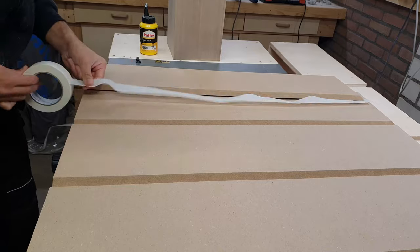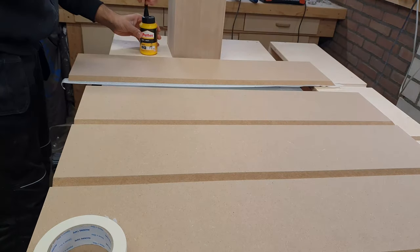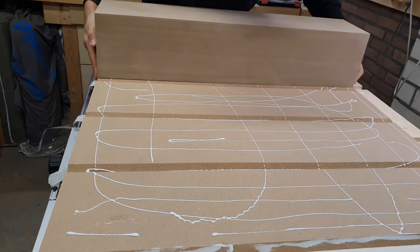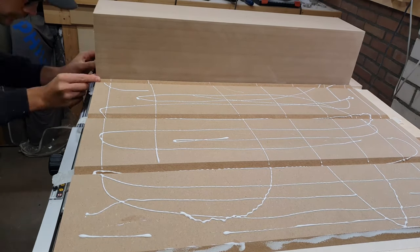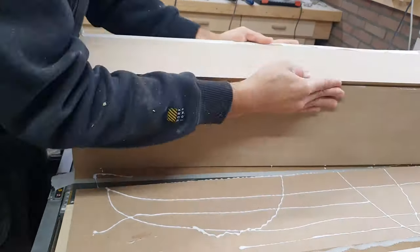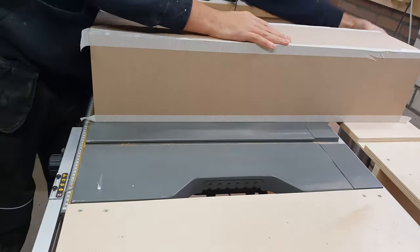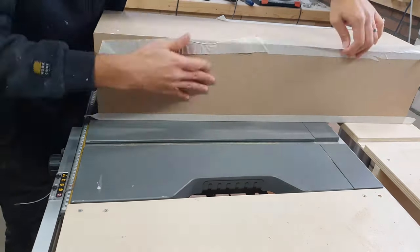The final step in the assembly was to wrap the center with the sides. The sides are mitered at the top and at the corners so that the lid can fall into it and you get a nice sharp finished edge all around. To make this step of wrapping it a little easier I used painters tape to hold the sides together. I then applied glue to the sides and folded the whole thing together. Because of the weight of the center it didn't quite work according to my plan, but it was good enough.